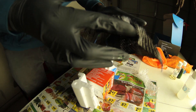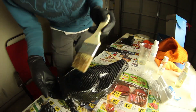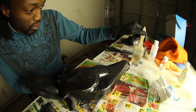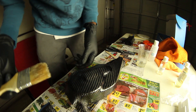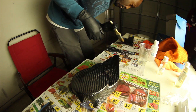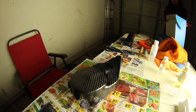Here's another mistake — I'm not sure what I was thinking. In the previous two parts I never manhandled them while applying resin, but for some reason I did here. You definitely do not want to move the part while coating the epoxy or laminating the material. You want a stationary jig or mold setup. I still wanted to share this video because it's a huge learning experience — we can both learn from it.